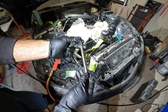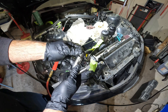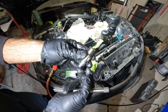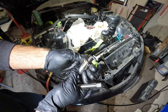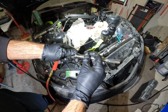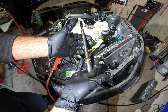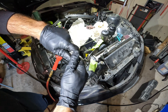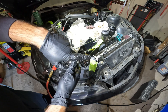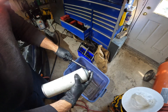Pro tip: we have this large tap, and a lot of people don't have the adapter for it. If you take an 11mm 16-point socket — you can get this at Harbor Freight, this is a Pittsburgh one — this end fits in relatively perfectly. There's a tiny bit of movement but you don't need to worry about that. I have an adapter from half-inch to three-quarter, and that's what I'm going to use to tap the hole.